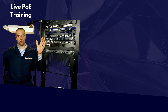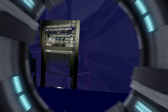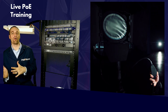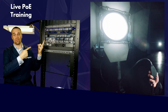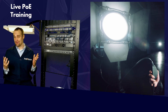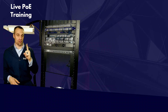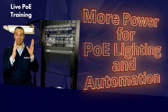Let's answer what all this means. Active versus passive PoE controls how power on the port turns on. Active PoE does not turn on power until it recognizes a PoE-enabled device connected on the other end. Passive PoE means the port has power on at all times. Why use passive? Two reasons: some specialty devices require it, and passive PoE can deliver more power on infrastructure applications like lighting and automation. It still has protections to shut it down, but it just has power on all the time.